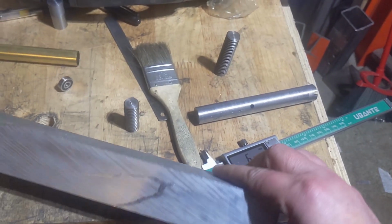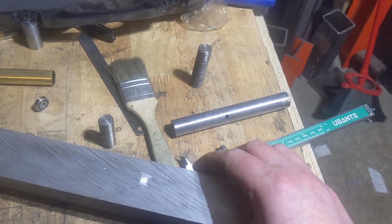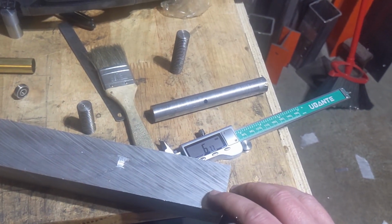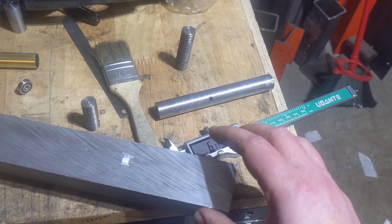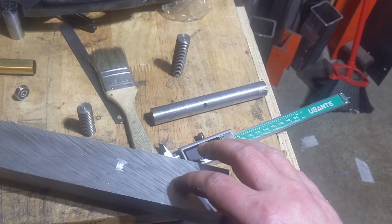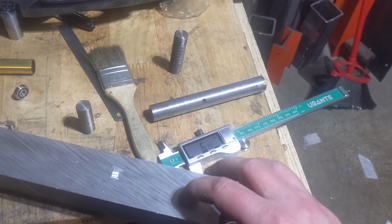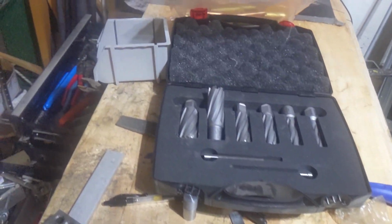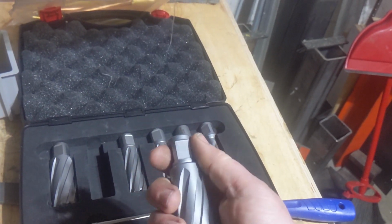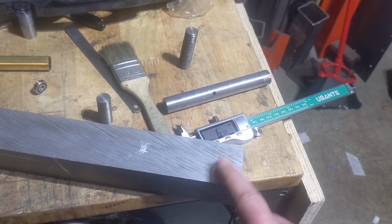The problem with using this material is I need a cutter that'll cut 40 millimeter thickness, and I don't have my R8 spindle hooked up yet. So I'd need to either get the R8 spindle hooked up and working, and then put a tool into the R8 collet, which would be long enough to do this. So that would be one option, which is a bunch of yak shaving. The second option would be I could make an adapter for this to put it in the drill press. So that's a bunch of lathe work, more yak shaving. So it looks like I got to shave a yak if I want to use this material.